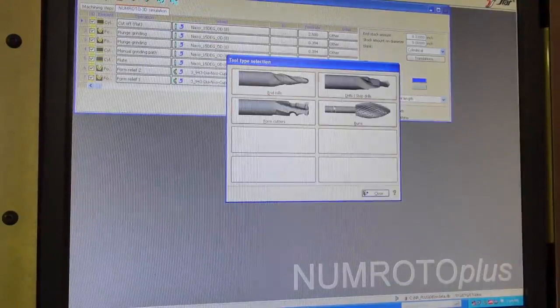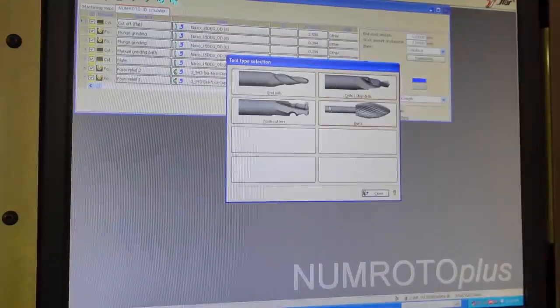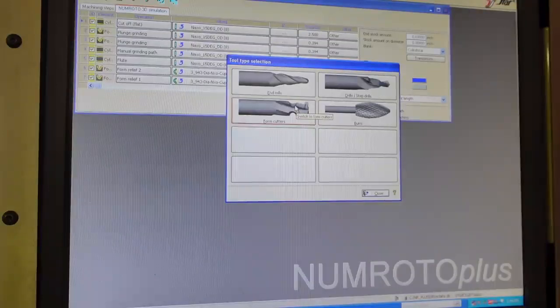this here, and now I guess there can be many more modules to this software that I don't have here. I only have to grind end mills, form tools, which can be an end mill or any kind of form tool of some sort, like you see in the picture there, almost any shape you can imagine, and any kind of flute spacing, any kind of helix angle, anything. The end mills themselves are a little bit more restrictive than this.